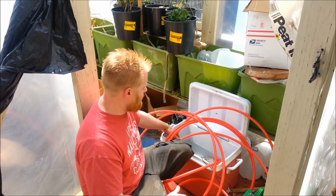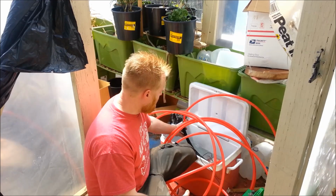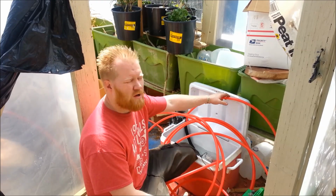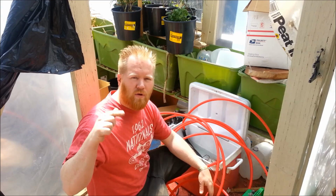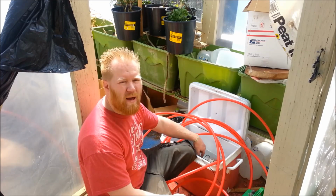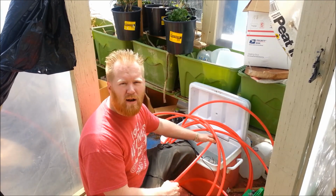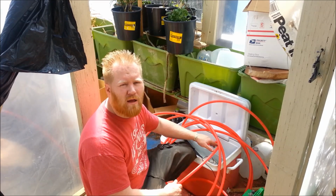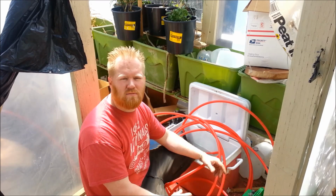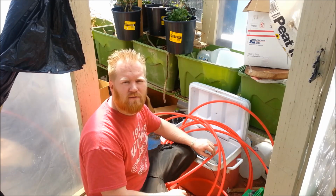But you start off and this is a non-pressure system, so you don't have to worry about boilers and blowing yourself up. It's all open, so if the water starts boiling, no big deal. But it starts at the bilge pump, runs out to the fire, around the coil in the fireplace, back out to the heater core, out of the heater core, back into here. That's all it is. I could shorten these loops a lot if I wanted to. And this is all just PEX tubing. It's rated at 100 PSI at 180 degrees Fahrenheit. So even if you got this up to 200 degrees or so, you wouldn't have to worry about it because it's running at 0 PSI. No worries. You do need something that will handle the hot water, and this stuff's pretty cheap, usually about 30 cents a foot or something to that effect.